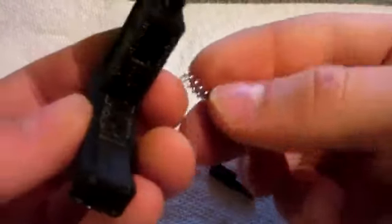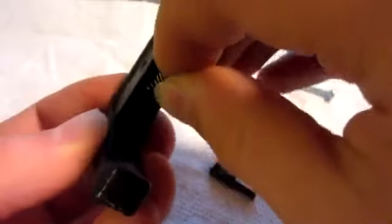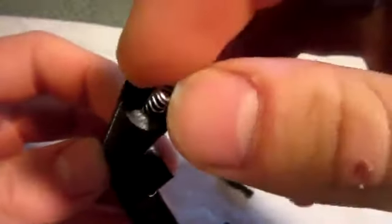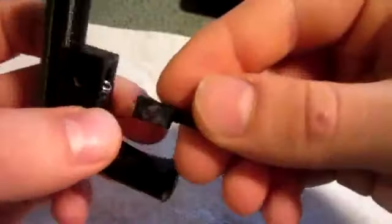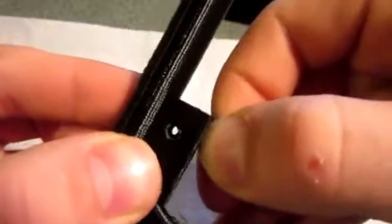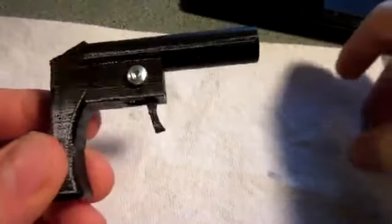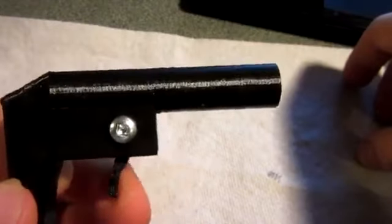First we are going to take the spring that holds the trigger in place, and there is a little hole I designed in right there. We are going to put the spring in that hole. I might not have designed the depth deep enough, so let's cut that down. There is the shorter spring inserted into the hole, and now the longer spring we are going to use for the propeller — I'm just going to drop that in the barrel. Then the last step is the trigger, which we insert into the little chamber, push down the retaining spring, and line up all three holes. I can feel the tension on that already, which is as I designed. Then this pin should just slip right in. There it is everyone — my very first 3D printed invention. It functions very well. I pulled the trigger and it has a nice bounce back action.